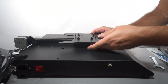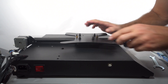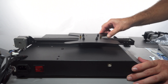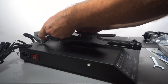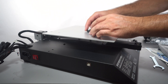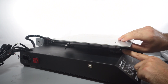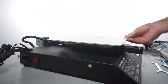One way to check them: stick your finger in there and while putting pressure, spin the wheel to see how tight it is. If they can spin fairly easily with just a little pressure and the thing still doesn't wobble, you've got it perfect. Now I can put the bed back on — the springs try to run away, but do one side then the other. Grab the knobs and screw them onto the bolts, compressing the spring about halfway so when adjusting bed level later you can go up or down.